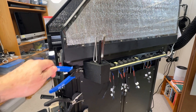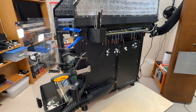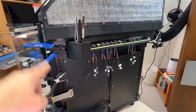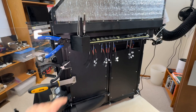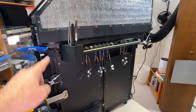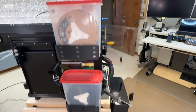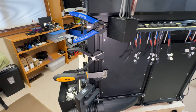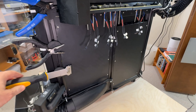I have installed magnets on the 30-30 aluminum extrusion in the front corner. The Prusa XL doesn't have an extrusion in this front corner, but mine does on both sides — that's one of the modifications I did to give myself structural mounting points. I didn't think it was a harm to make the structure a bit more rigid, but primarily I wanted hard anchor points here and on the other side, particularly where I have the filament dry boxes. I threaded magnets into T-nuts, so the tools I use while printing actively attach with magnets.